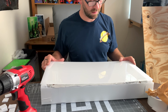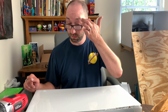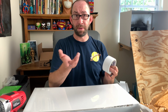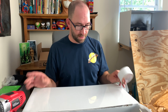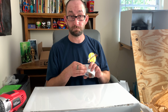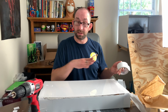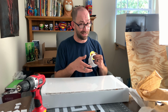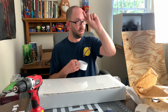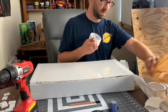So, like that. And guys, you probably could also get the covers for fluorescent lights that you would get at Lowe's or Home Depot, or you might be able to go to Walmart, I don't know. But you could even use one of them. It would do the same thing. Or if you have an old ballast for a fluorescent light, you could just put the LEDs in there too. That would work. Or they actually sell LEDs that would fit in those. You just have to watch which ones you buy, because some of them you have to remove the little black thing inside. So just be careful what you buy. But anyway, let's finish this up.